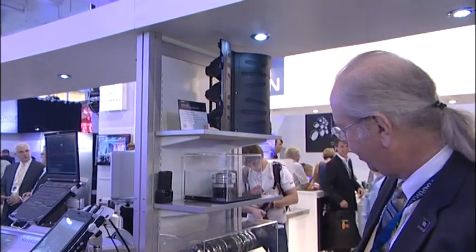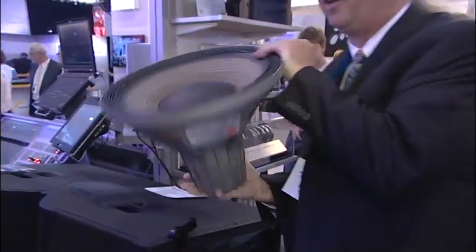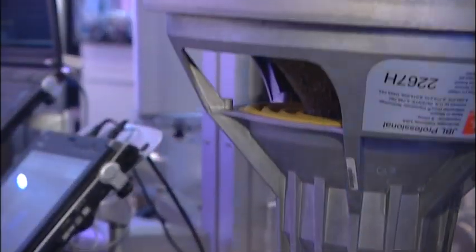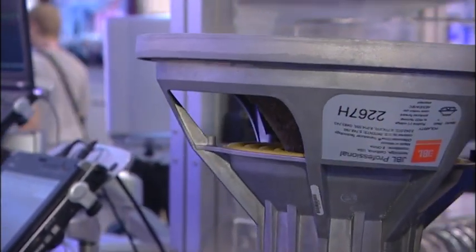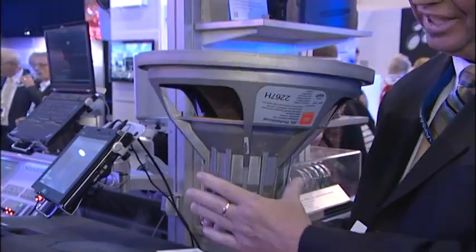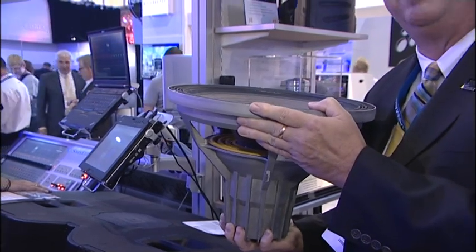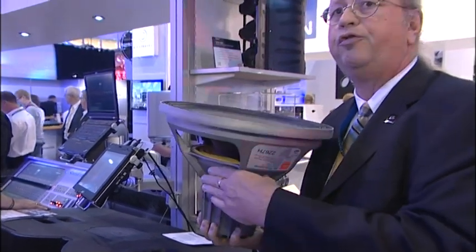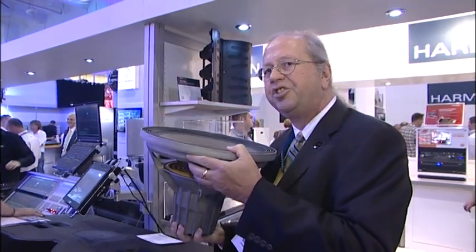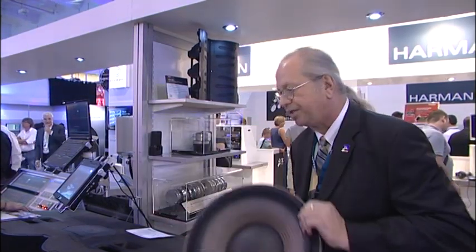This is a full-size line array with 15-inch woofers. Starting with the 15-inch woofer, JBL has a number of patents on what we call differential drive. This is actually a neodymium magnet with two voice coils on the same voice coil tube driving the cone, and a heat sink nest around the whole assembly. This 15-inch driver was purpose-built for the V25 — it's the first time we've done two four-inch voice coils. The driver has a 2,000-watt AES pink noise rating or 8,000-watt peaks, and we have two of these drivers in the VTX V25.